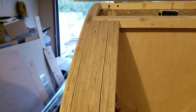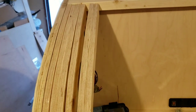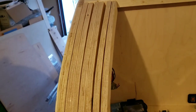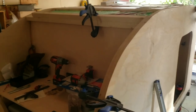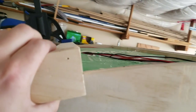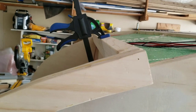Alright, so it took a while, but we've got 1, 2, 3, 4, 5, 6 spars. We're gonna take 2, glue them together, have 2 in the middle, and then another 2 laminated on the other side. So we'll have strong outer edges here. We don't have any way to clamp something that's over 4 feet, so we put our vertical spar here, horizontal spar there, clamp them to the trailer wall. And now we can do some pre-drilling, and that should work well for us. A little bit of a workaround.